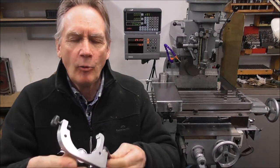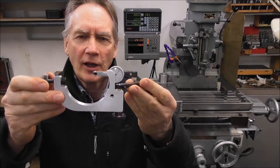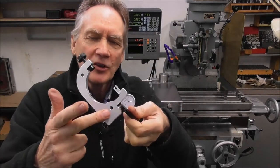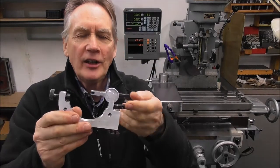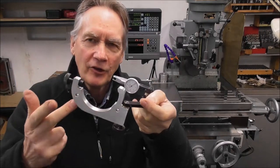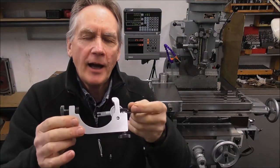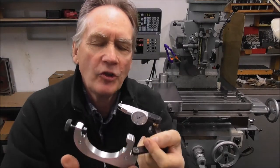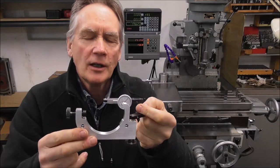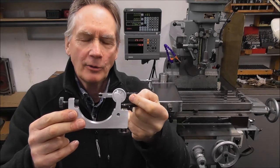In this video, I want to go into a spindle type dial indicator holder. What's making of this J-type clamp? If you've got a CNC machine and you'd want to make one of these, you can profile out this shape, and I'll go into a method of holding a part which is to be profile machined that you could call standoff holding or packer holding.